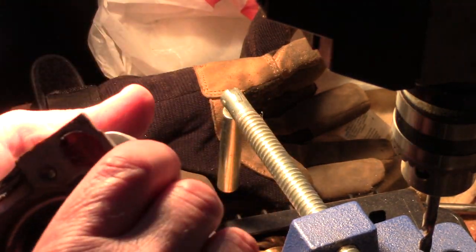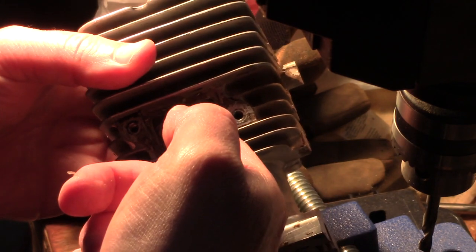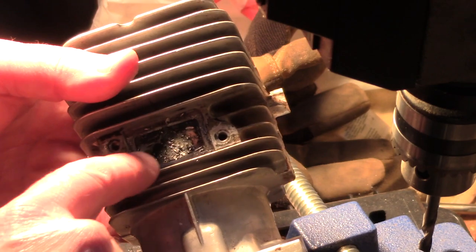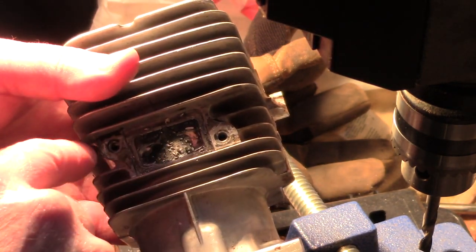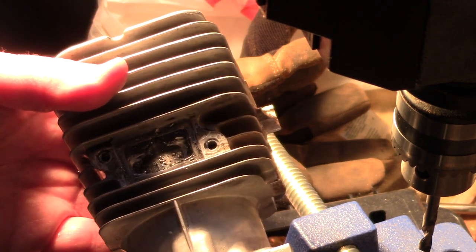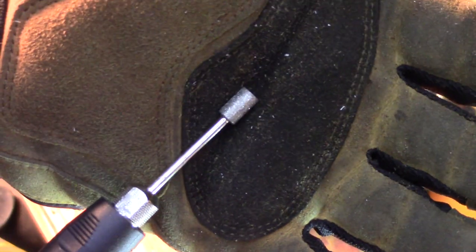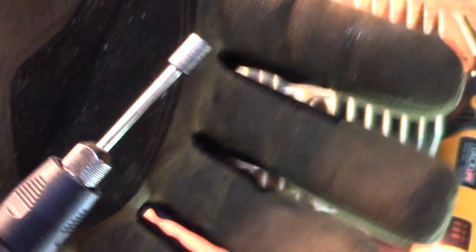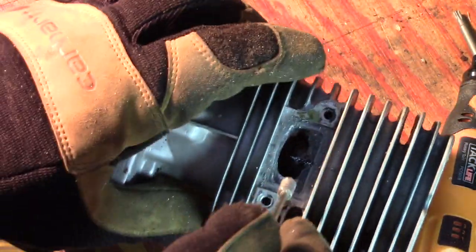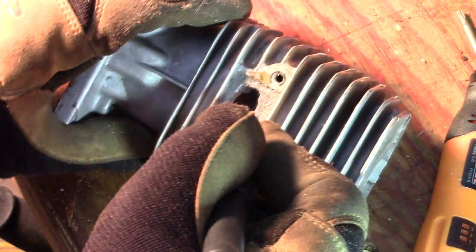You really don't want to push through from the outside into that chrome because you could make it brittle. So now I'm just going to be using a hand grinder and going from the inside, working my way out. But I took a chunk of that soft aluminum out just to speed things up and not bugger up my hand grinder. Here's what I'm going to use for a bit — it's just a diamond bit that is usually used for sharpening a chain.